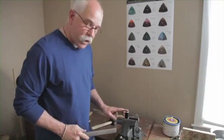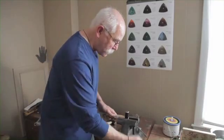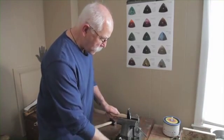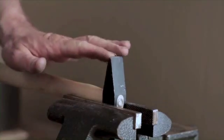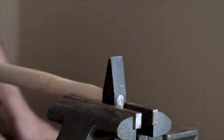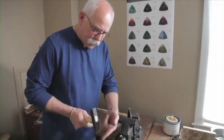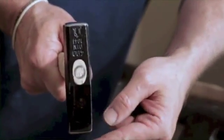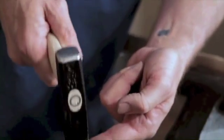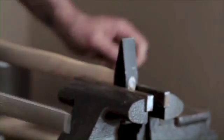I will continue this all the way around, but you don't need to watch that. Let's flip it over and go to the other end and soften the cross-peen. In this case I'm in pretty good shape — it's got a nice curve already, so I just want to knock off the corners. The reason I want to knock that off is when I get to the forging, if my finger was a rod and I strike like this — do you see where that corner falls? If I strike like this, that corner is going to make a dent, and that can be a problem. So I just want to round that off, and I'll just use the file.